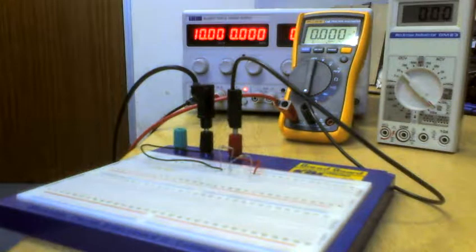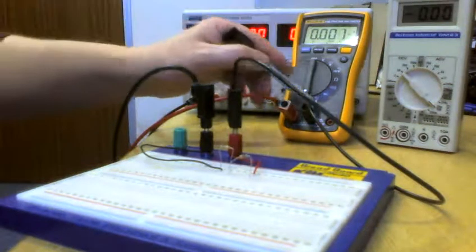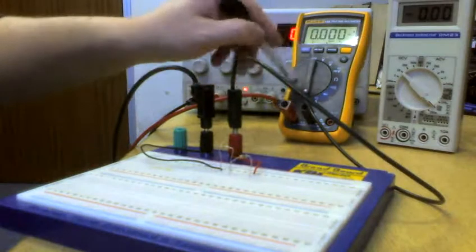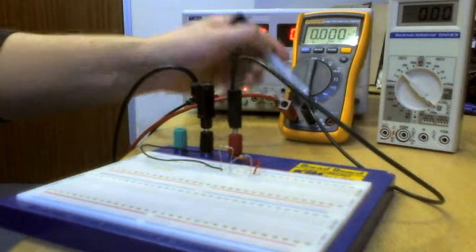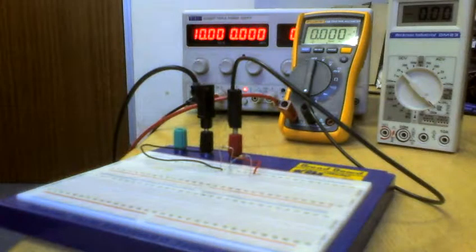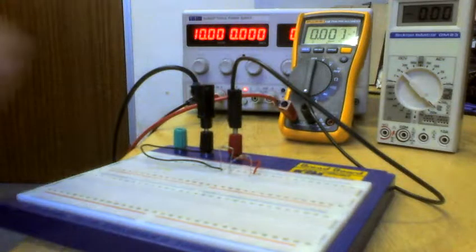There are some problems with measuring currents with multimeters, and that's because they've got shunt resistors inside. There's actually a resistor between the two terminals — the multimeter is actually measuring a voltage across this shunt resistor. The programming inside is just performing Ohm's law to convert that measured voltage across a known resistor into a proportional current. So the voltage is proportional to current — if this is one ohm and it's measuring one volt, you'd measure one amp.